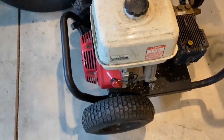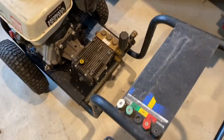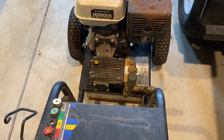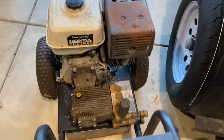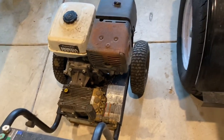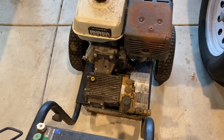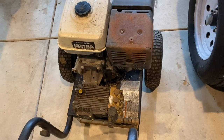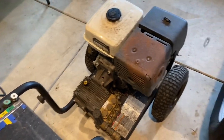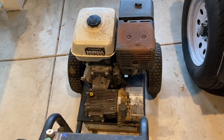The tire luckily has air in it now, but these things were flat. No hose, no gun — but really anybody that has a business already has all that stuff, so it doesn't really matter. AR direct drive pump. If I was really going to put money into this, I would put a gear drive on it and use it for smaller stuff. If this pump works, I'll use it until it doesn't and then change it out to a gear drive. There's no reason to go belt on this. I've never had a gear drive, and that's one reason I'd want to go that route — plus the footprint is going to be a lot smaller.